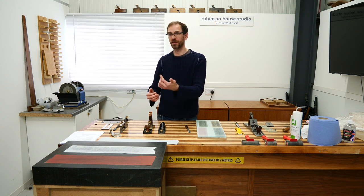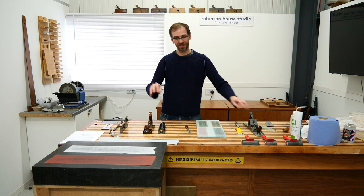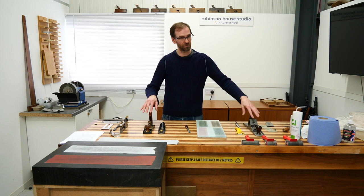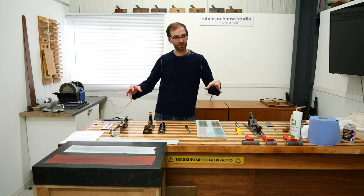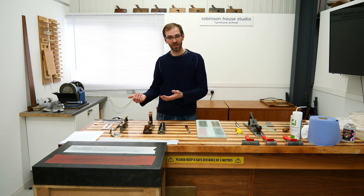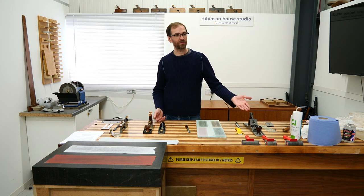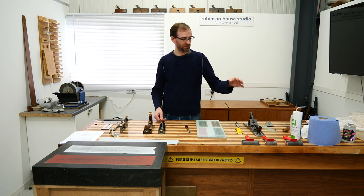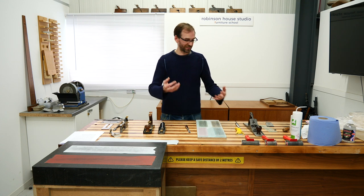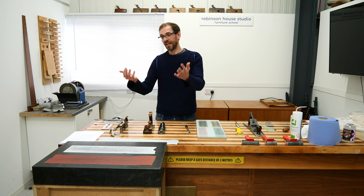For students, the low-angle plane was added to the tool list because this standard plane tears out and the low-angle very rarely does — especially important when you're beginning. In a commercial environment where you want to make money making furniture, you're not hand-planing things for days; you're using machines and planing close to dimension. As an apprentice I spent a whole year using only hand tools, so a couple of millimetres off the top meant planning the whole thing — blisters and mountains of shavings — but that's not wise if you want to make money.